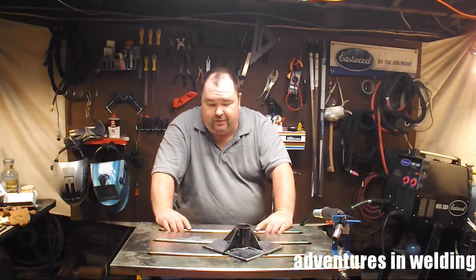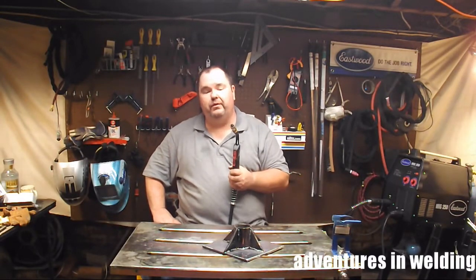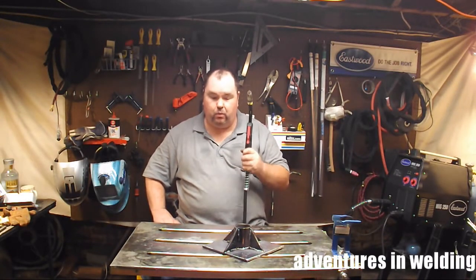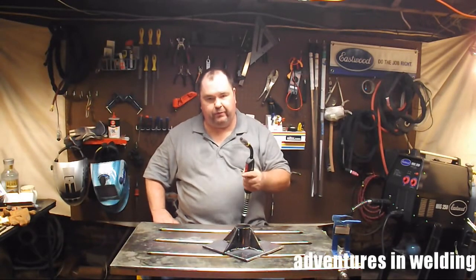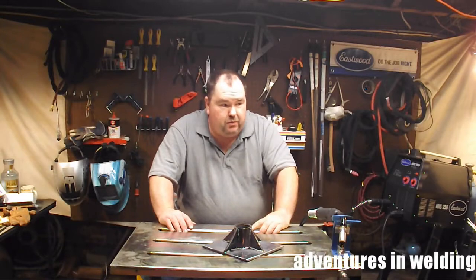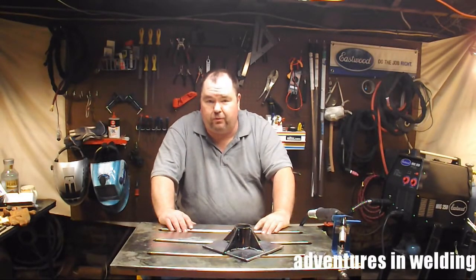Alright folks, that's it. That's the end of this little basement shop project. Made easy with the Eastwood MIG 250. Like I said at the beginning, I looked over all the different processes, stick, MIG, TIG. I don't have any oxyacetylene here. And decided what would be the best process, what would suit this job. Turned out I like the MIG process for its speed, ease of use, and good penetration. I'm using 75-25% gas. Tomorrow I'll go to the old Happy Hardware Man, get a new piece of 4-foot long 2-inch stainless steel pipe. Drop her in there, plop the drill press on top of it, bingo bango bongo. My cheap Chinese import drill press is now a floor model drill press.